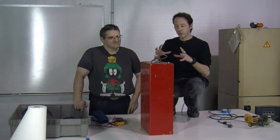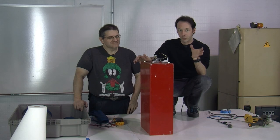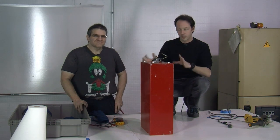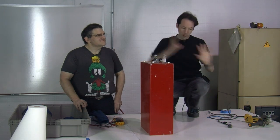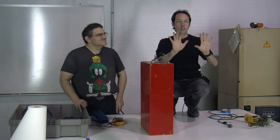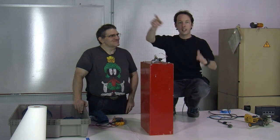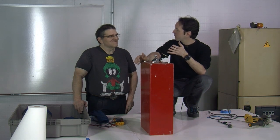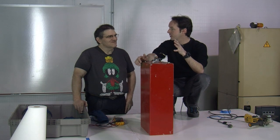It's got all the stress of being charged, and then we discharge it, which puts it under unimaginable stress because all that energy is rushing out and all the electromagnetic forces come into play. And then it swings back, because it doesn't just dump all the energy down. It rings, as all the energy goes back and forth, like letting go of a swing set. It's kind of like the backwards version of how a Tesla coil works. It's not resonant, but it does ring.